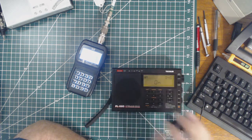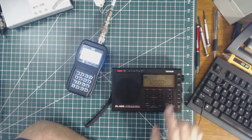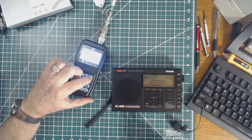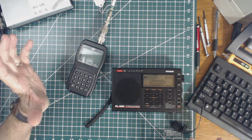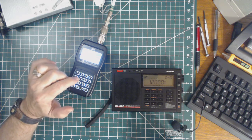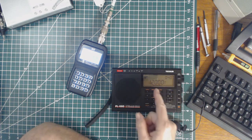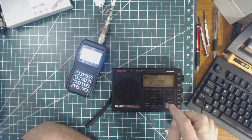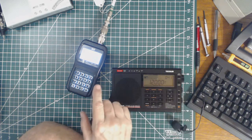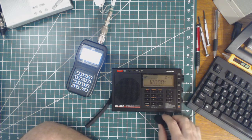Okay, there's the chain of pulses that the analyzer is putting out. I can turn the analyzer off and the pulses go away, turn it back on, select that mode again, and there they are. It's tuned directly to 12 megahertz. Let me detune the radio and get some idea how wide that set of pulses is, so I'm going to move the microphone a little closer.